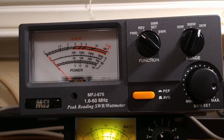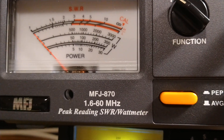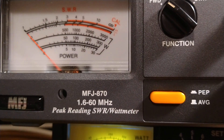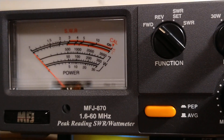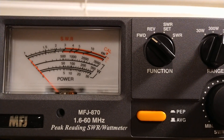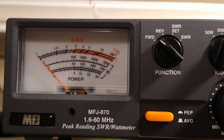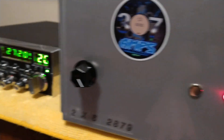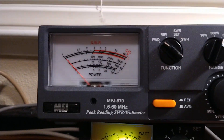It's reading well. 1901 had a thought that these have such a big span for what they read that perhaps it's not going to read at the bottom end as accurate as it should. But anyway, we've adjusted all three power settings off of a known-good meter, with three different radios. We've tried three or four different radios on it and they're all dead on. So we've got the variable wide open, and the dead key is right about 2.5 watts on there. We're on the 3,000-watt scale.